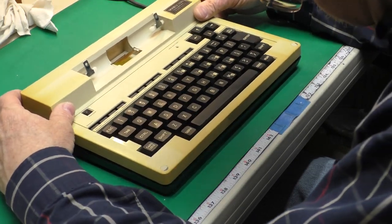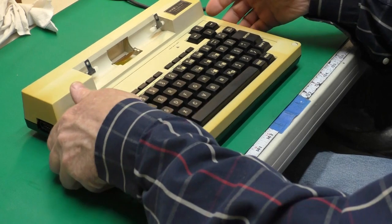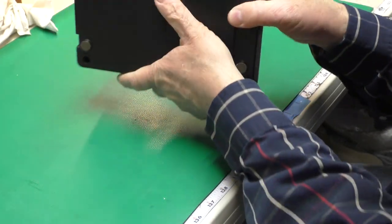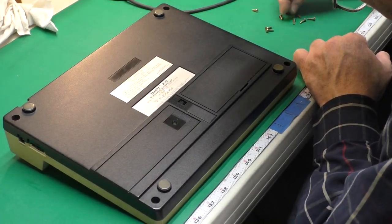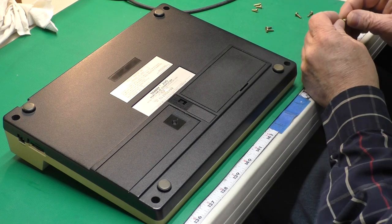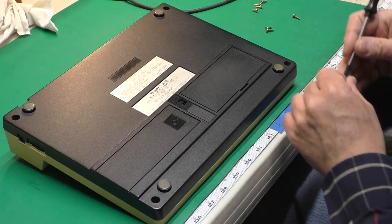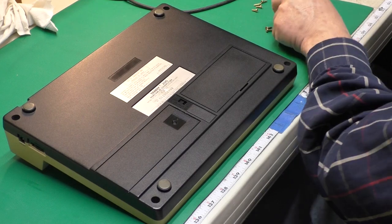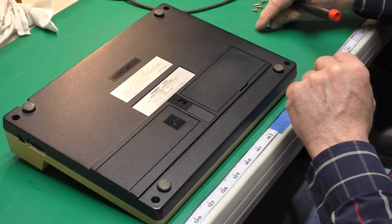Okay, LCD cable, wiggle all that back in place, just checking it all around the seams. Four of these that have a little paint on them, which is for the LCD. These other fours are for the bottom cover. Just remember counterclockwise just a bit until you feel a screw drop. And start it clockwise.